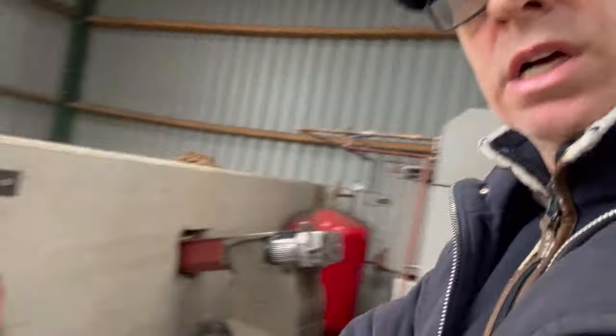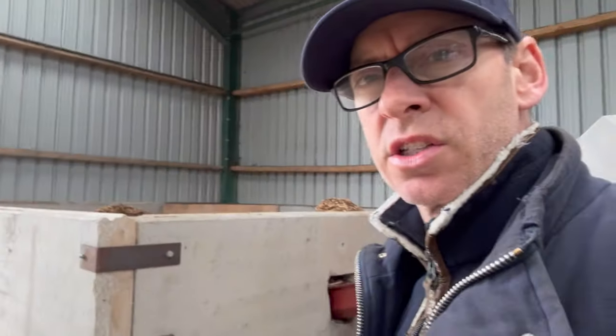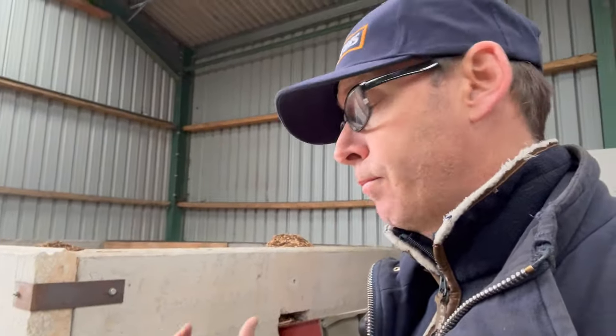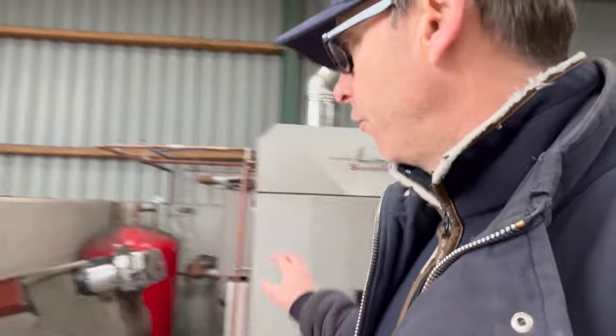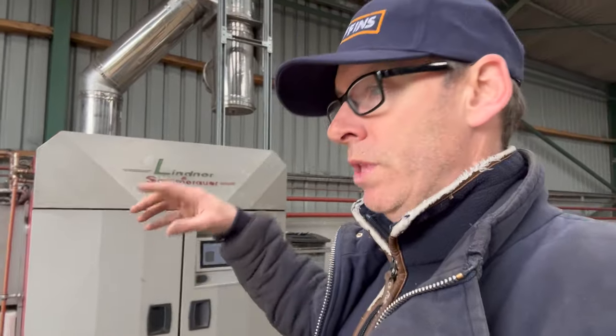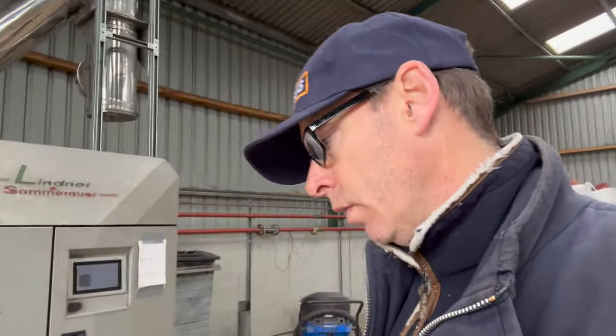And we got new fire bricks as well. So those are the old fire bricks. I think I showed you the other week that a couple of them had broken down. Those are now just spares. But we've got new fire bricks in, so they're not falling over anymore. They're sitting really comfortably around the grate. So when the grate moves, the fire bricks aren't moving and falling over, which was the problem before. So that's working well.